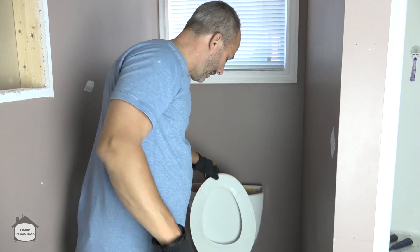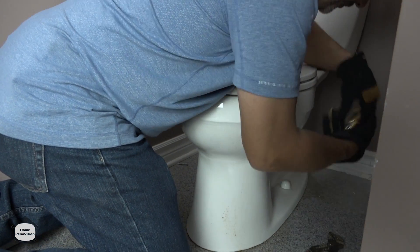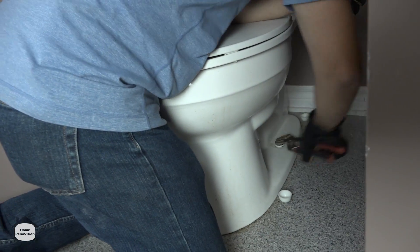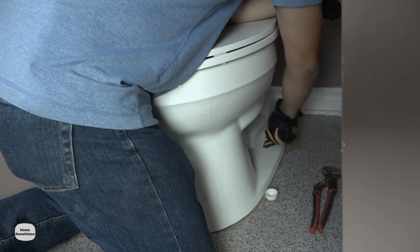You're not going to be 100% successful in that endeavor, but it doesn't really matter because my technique is a two-man technique. Here are the bolts — most bolts have a cap on them and they snap into place. The trick is to just get underneath and pop it off. Now you'll see the setting bolt — just a brass bolt attached to the toilet flange. Sometimes you need pliers, but once you get a couple of twists, usually they'll just run off with your fingers.